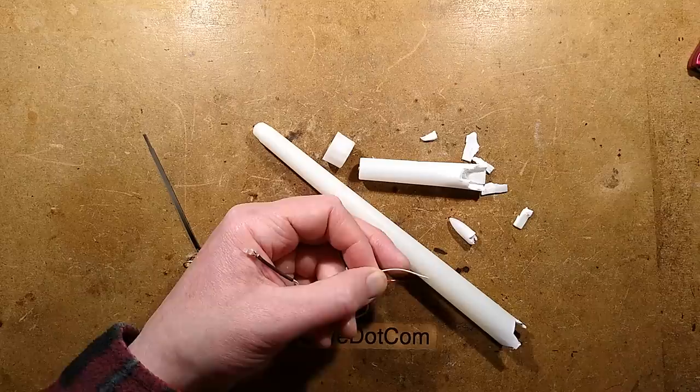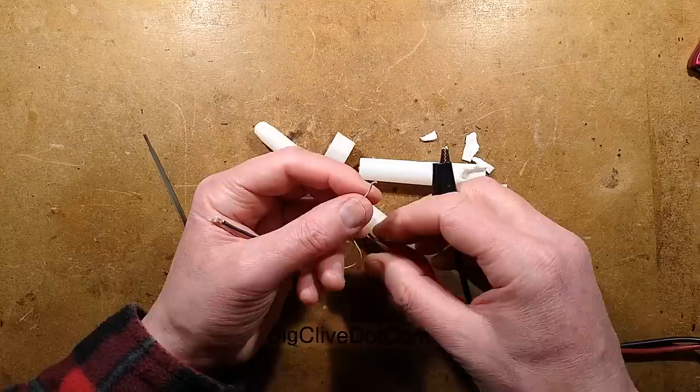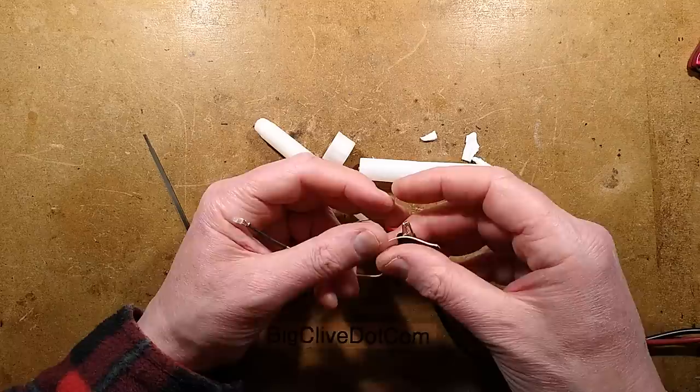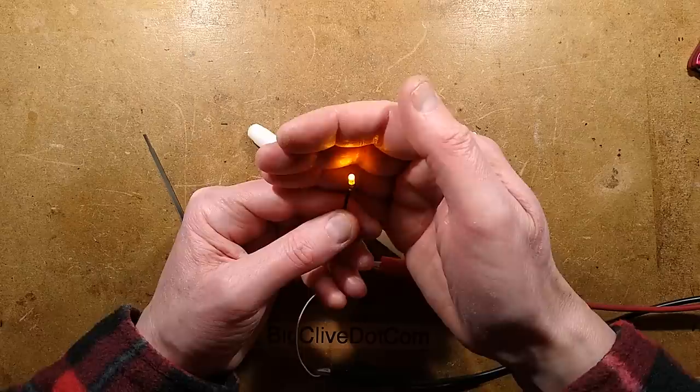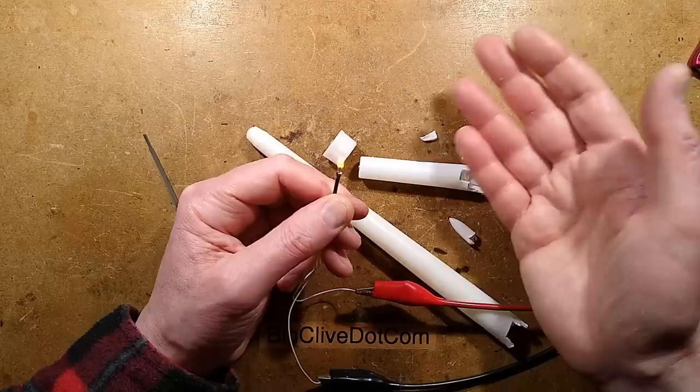So there are 2 wires, a sort of very lightly yellow tinted one and a white one. The white one is the positive. The wires are so excruciatingly thin that they won't even go into the clips here. I also noticed that you can crash the LED. It sometimes just jams on at full. But in this case, it has reset after being powered down for a moment. Quirky. But that's it. An undulating, flickering LED and a battery pack. That's all you've got in here.